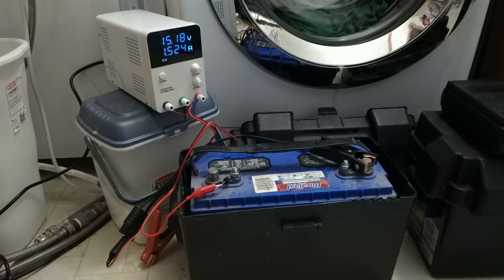So I decided to see if I could recover them. What I needed to do was get an equalization charge going, and for these batteries that meant running them around 15.2 volts — to bring them up high enough where I'm overcharging them slightly to break down those sulfate crystals on the plates, get the plates to shed them off, and to vigorously cycle the acid.